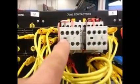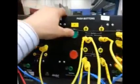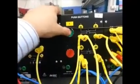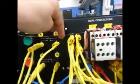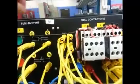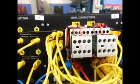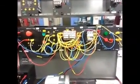Start it up again. You'll notice that this contactor has been sucked in — that means this is running and that one is not. It is designed that if I was running in this direction, pressing the green button to go reverse will not do anything, because you have interlocked it and stopped the current flow from this stop button to energize the coil, because these are now normally open. This is what you call an electrical interlock. So that's your lab — looks pretty crazy and messy, but I'm sure you can get it to work. Good luck.